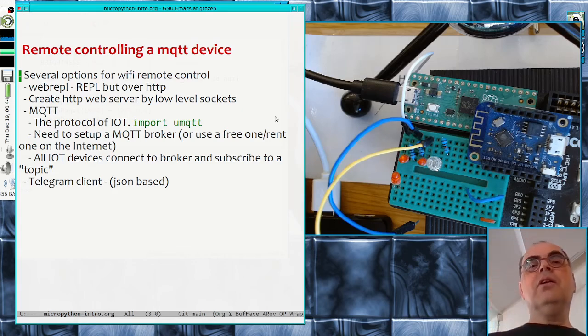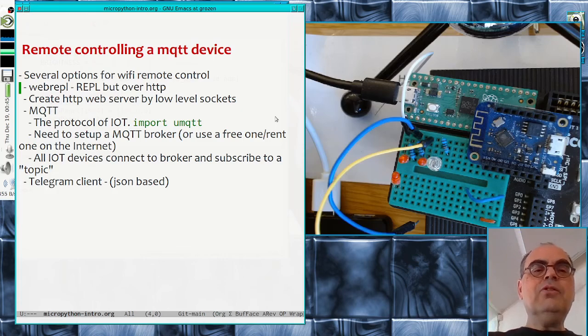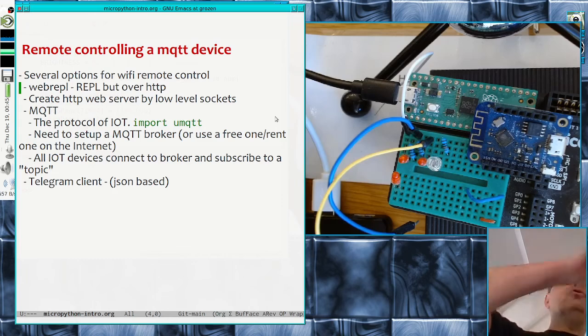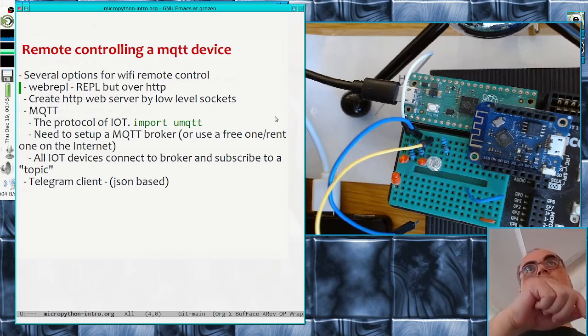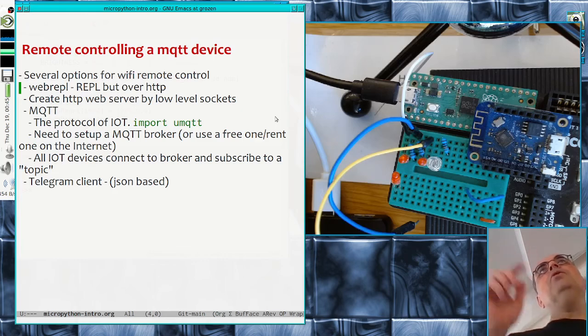One of the most common protocols that was developed for IoT, the Internet of Things, is a protocol called MQTT. MQTT is based on the idea that you have a broker in the middle, and you can subscribe to messages from this broker, like a server for a small device.